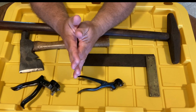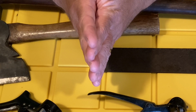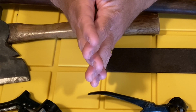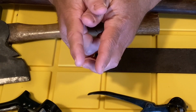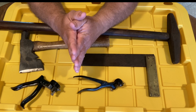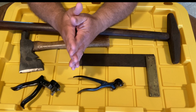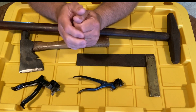The saw blade has teeth on it like this, and you don't want it just straight lined up, because then the wood will end up binding on the blade. So you set those with an offset on each side, and that creates what's called a kerf, so that the gap you're making is wider than the blade is. And so when you have to set that, if you set it too much, you're doing a lot of extra work and it will dull more quickly and it just isn't efficient. If you don't set it enough, it'll grab your blade. So you just have to know how to set those things so that each tooth is set opposite one another on your saw blades.